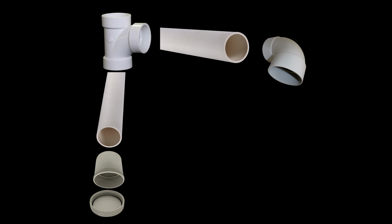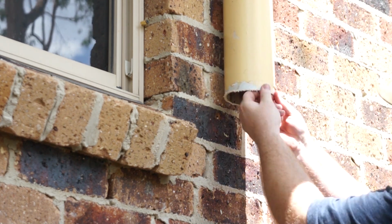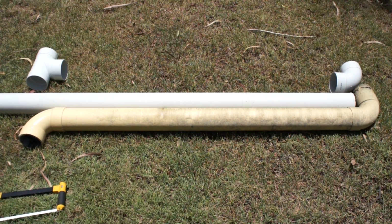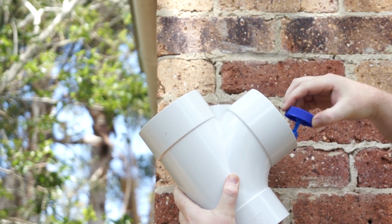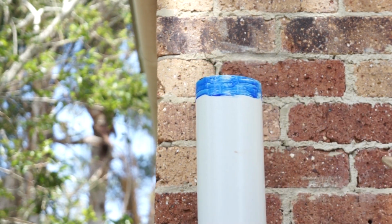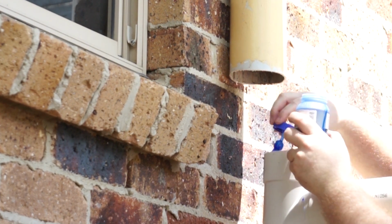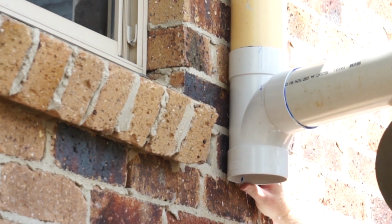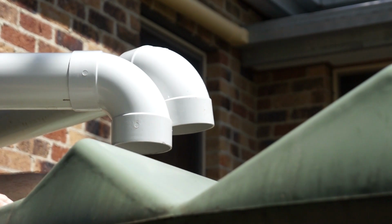The first thing to do is remove the old inlet. I used the existing inlet as a guide so I could cut my new pipe to length. Once it was cut to length, I then attached it to the plain T using standard PVC cement. I then attached it to the downpipe using the same PVC cement, but being careful to make sure that the end was over the inlet into the tank. I then just dry fit the 90 degree elbow to the end of the inlet. The reason for this I will reveal in the next video in this series.